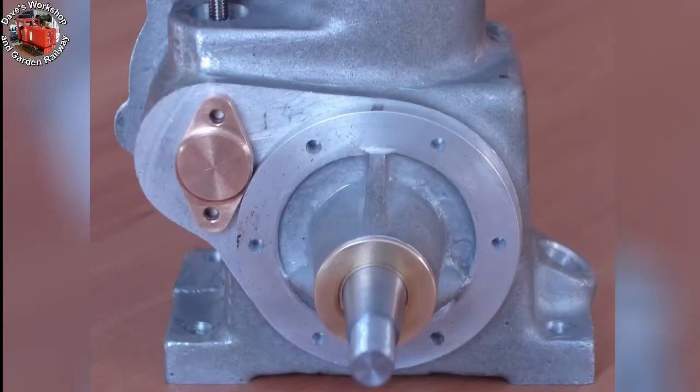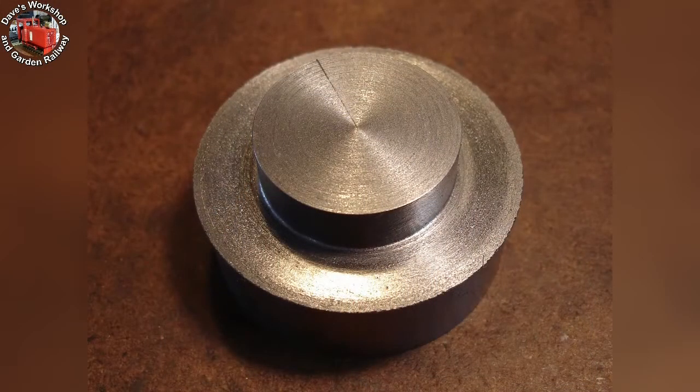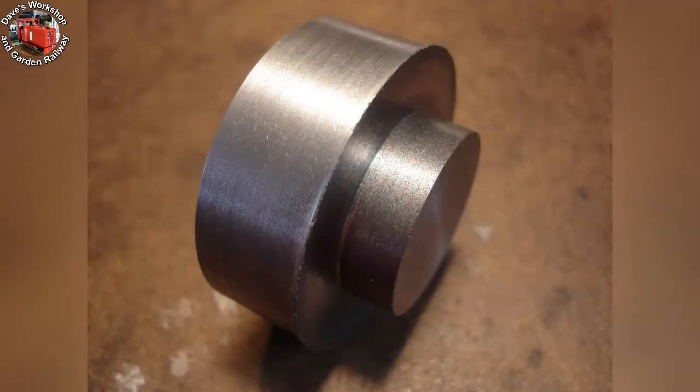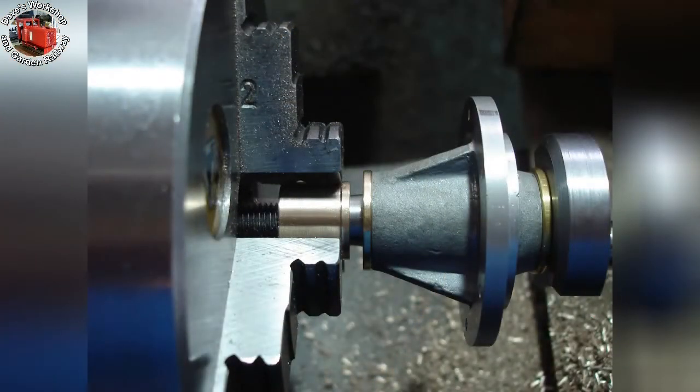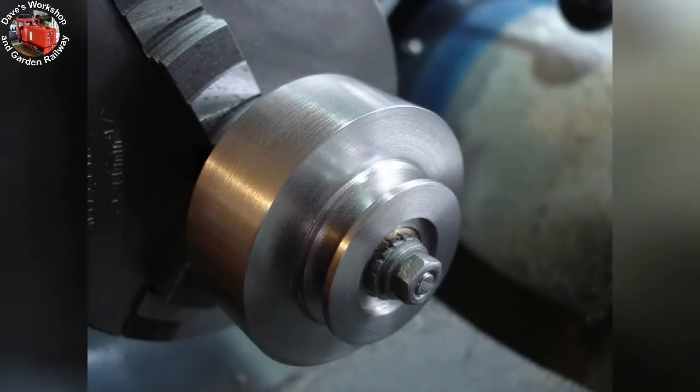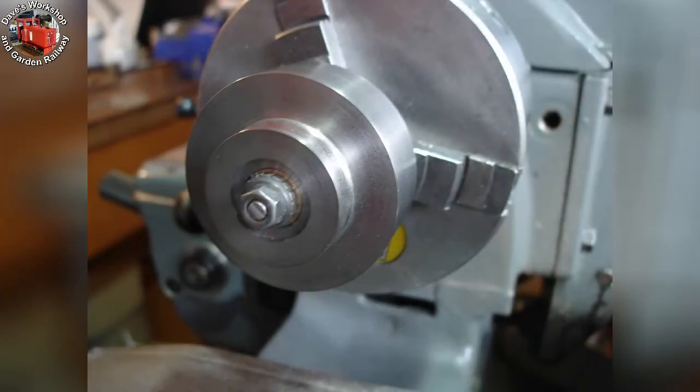The screw holes have been drilled in the main bearing housing. The nasty flywheel casting was a shocker, but I was determined to push through with it. There's a distinct lack of material inside — it will need bushing to get enough crankshaft taper engagement. The exterior is roughed out. I made a brass bush for the flywheel, checking the length of the taper engagement as I bore the taper. Bush loctited in position. The washer recess has been counter-bored in the front of the flywheel. I had to make sure to clamp against the bush only and not the cast iron, or I could break the bond.